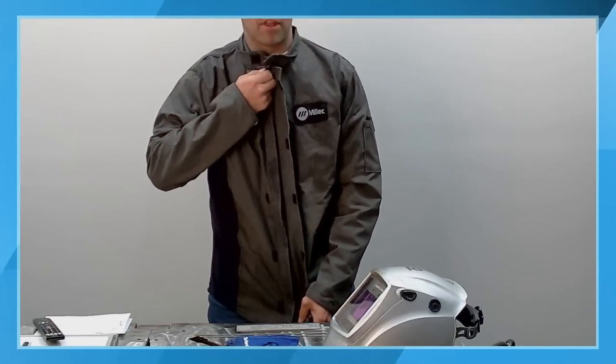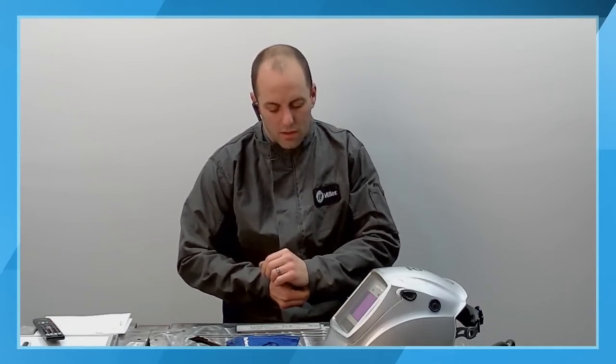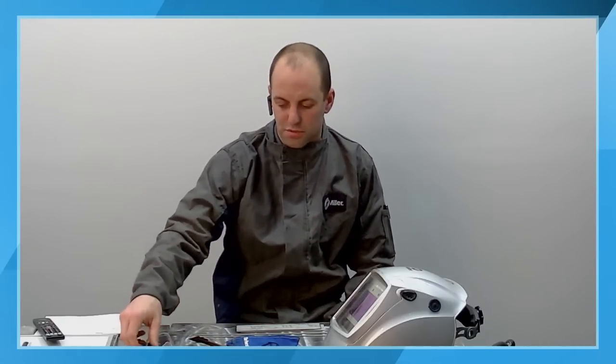We had a question come in the chat while I'm getting suited up: is there a difference between the Dynasty 280DX and the Dynasty 300 that we're utilizing today? The answer is there is a difference in the output. The Dynasty 300 has a higher peak amperage, 300 amps versus 280 amps. As far as functionality, a lot of the actual weld performance has not changed. If you had a good experience with the Dynasty 280DX before, the Dynasty 300 is going to have the same arc characteristics that people have grown to know and love over the almost decade that the Dynasty 280 was available.